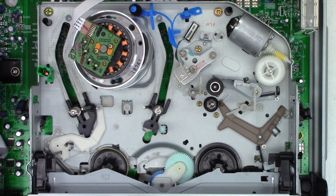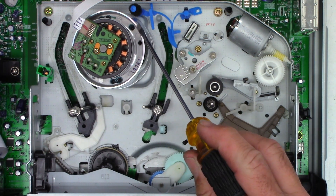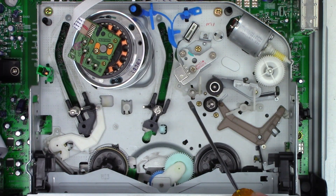The reason they have an audio erase head is because in record mode, the cylinder actually records up into the audio portion of the tape. If you don't pre-erase that audio, you can hear a high-frequency repetitive sync sound in the audio circuit if the head isn't perfectly adjusted. So they erase the top track and then re-record the linear audio — not to be confused with the hi-fi audio, which is what that cylinder head records.